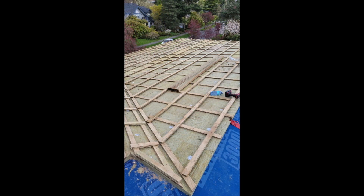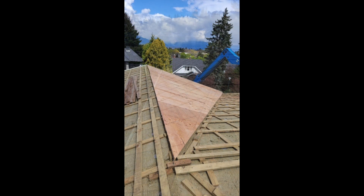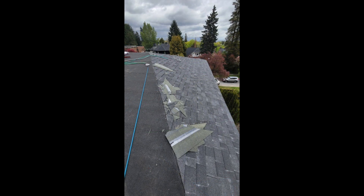We installed two inches of rock wool, which served as our continuous thermal control layer, though it could have been four or six inches as well. The vent strips are installed, providing venting above the thermal control layer. We resheeted the roof and installed the roofing underlayment, followed by the roofing — and my Red Seal carpenter son tells it best.